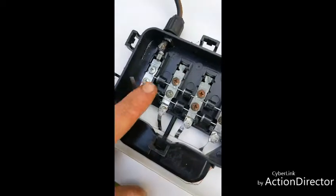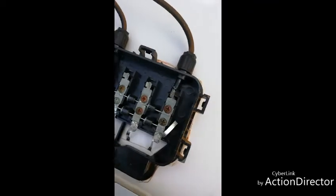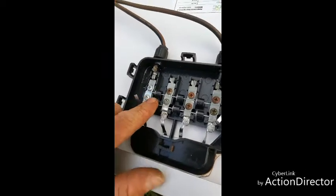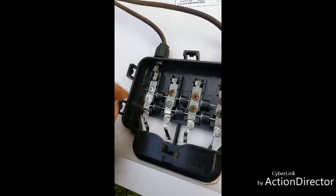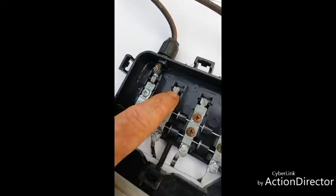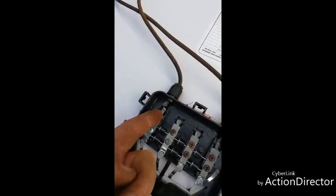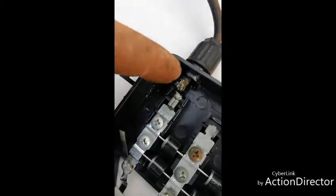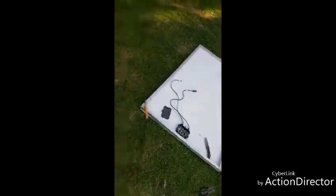I'm quite lucky - last time I had the diodes that popped, but as you can see right over here the wires are melted off. This is a quick fix - obviously you're going to use your meter to measure the diodes to make sure they only take current through in one direction. I'll show you that now. I just use the soldering iron, pop these off, and these ones are open so I swap them. This is the negative side, this is the positive side. The reason I turn the panel over is so there's no electricity on it, because they can shock you quite badly.